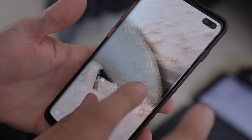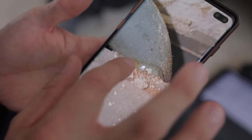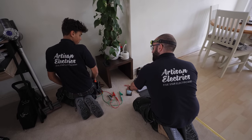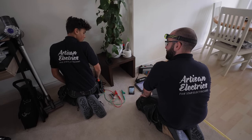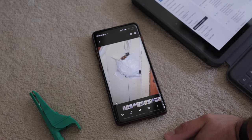Something going into the fuse board — I don't know if it's PVC migration or whether that's actually got hot and melted, but they seem to have fused together on the top of the fuse board. It's not actually insulated, so you don't need a tool to remove it — you can literally peel the tape off. If someone had heat-shrunk over it and you needed a knife to take it off, then you could potentially say it's a permanent fix. But that's really not. I'm going to disconnect it from the JB because it's in a cupboard where stuff's stored and you could be reaching around and touch that. So that's the first circuit done.